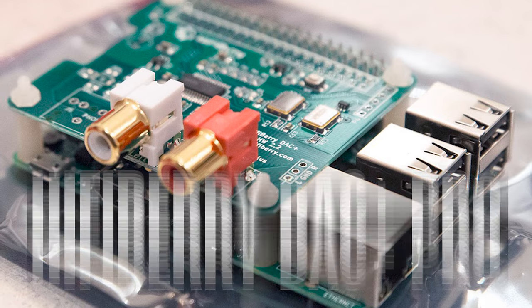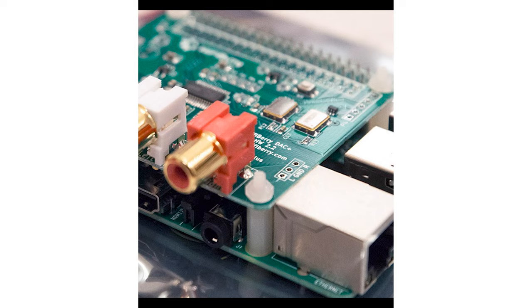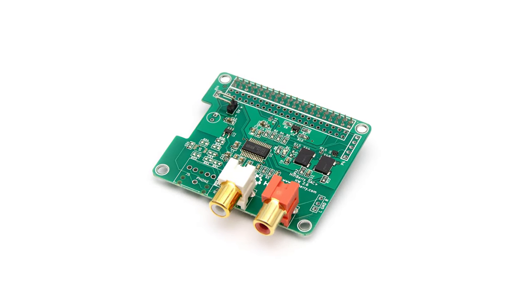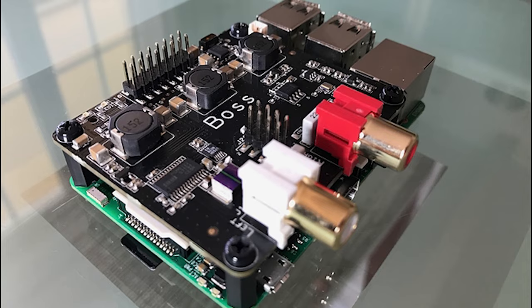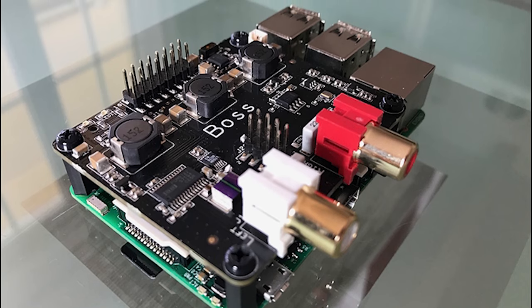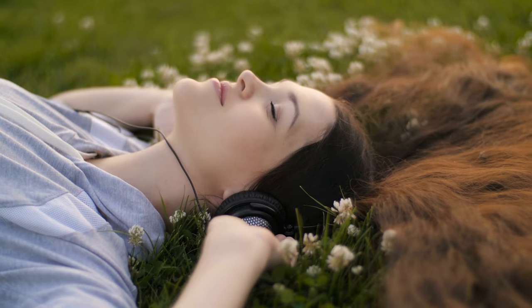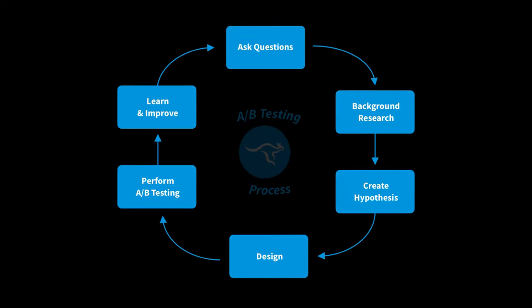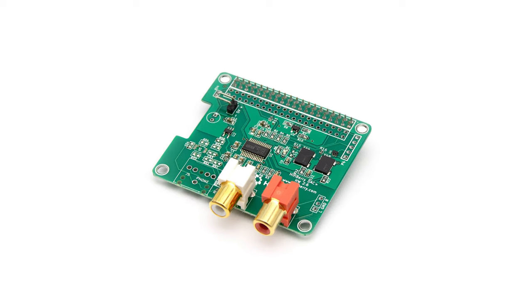Attached to the Raspberry Pi is the HiFiBerry DAC Plus Pro, which comes with a 192kHz 24-bit Burr-Brown DAC. It has an ultra-low noise linear voltage regulator and a hardware volume control, which you can use AlsaMixer to control the output. I am curious how the Allo Boss DAC will sound and if there's any audible difference in quality. However, the DAC Plus Pro sounds absolutely fantastic. I'm going to make another one with the Allo and do an A-B test, but I think the same Burr-Brown DAC chip that both DACs have is absolutely sufficient in either one.